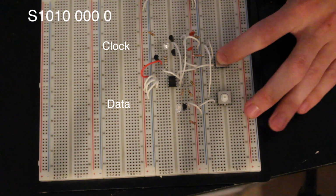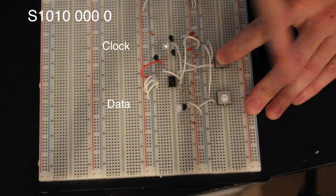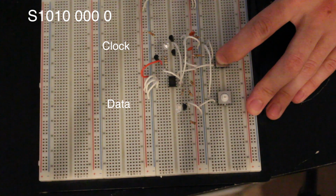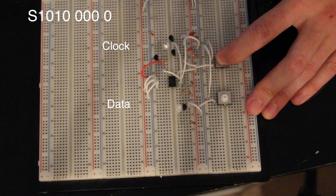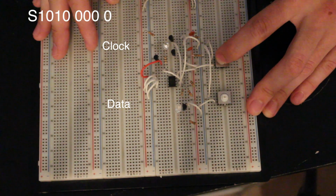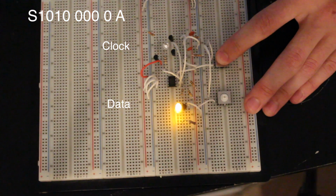And then I'm going to let go of the data line. Look, I let go of the data line, but now I'm not pulling it low. The device is pulling it low. This is the acknowledge bit. Okay, so following the start command and then the 7 bits of address followed by the write bit, which I wrote a 0 to, it acknowledges it. So the device now knows I'm talking to it. Okay, I'm going to write in the acknowledge bit, and now it gave me control back.